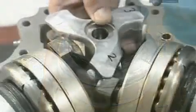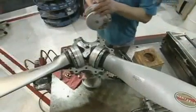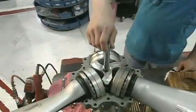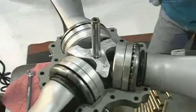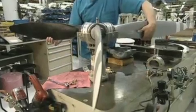The shanks of the three blades fit right into this steel part called the fork. It keeps all the blades at the same angle. Next comes the pitch change rod. The term pitch refers to the angle of the blades. Engine oil will exert hydraulic pressure on a piston that moves the pitch rod, which advances the fork, rotating the blades to the required angle.